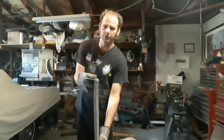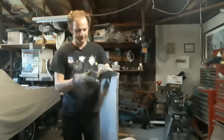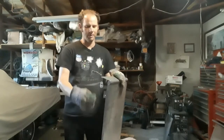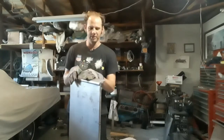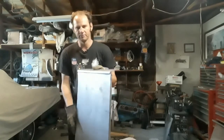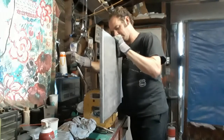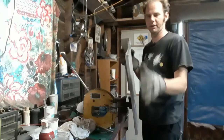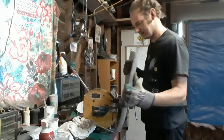The next step - as you can see the panel is flat, straight up and down. We need to get it to curve in, which we'll do by running these ends through the shrinker. The rear - I already have the rear door, so I'm going to shrink it to match that. The front I don't have a pattern for, so I'm going to get it kind of like the rear, only a little more subtle, which is about how it should be. And if it needs to be adjusted later on, that's fine - this is really easy to move around. I'd also like to point out that I'm shrinking these sides evenly - I shrink a little bit on one side, then turn it around and shrink a little on the other side, as opposed to doing everything on one side while leaving the other flat. It helps to prevent distortion.